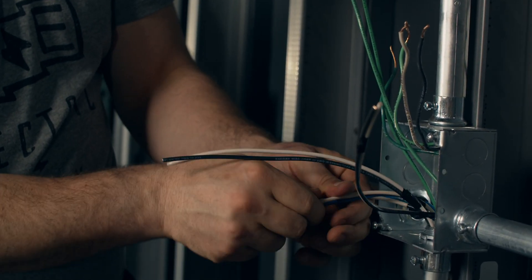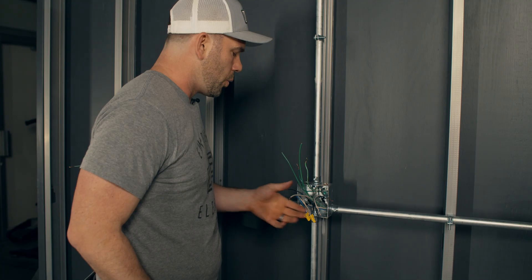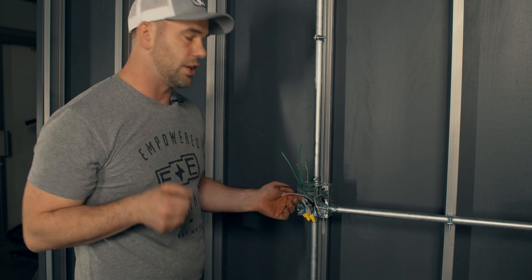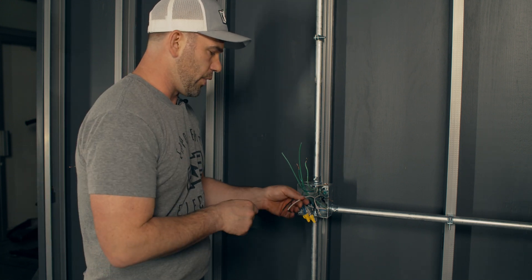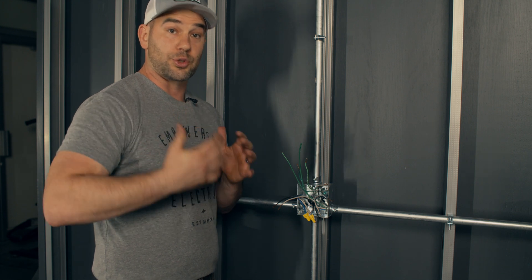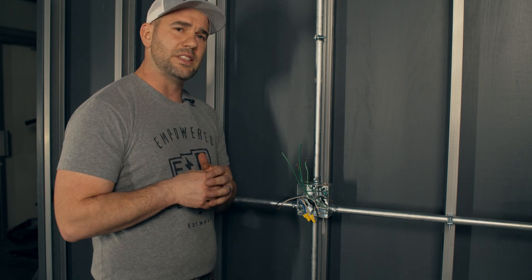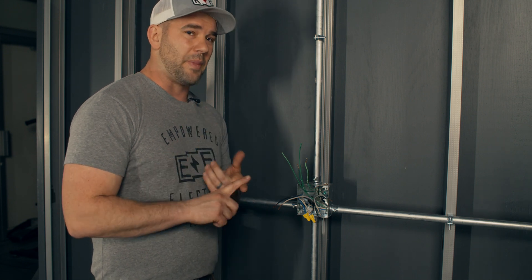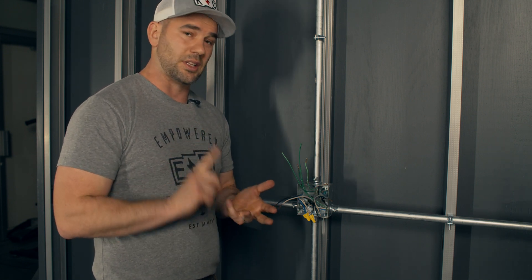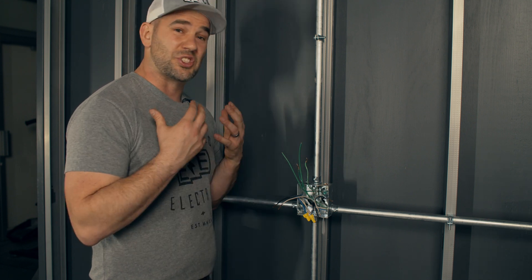Push them in the back. One of the reasons people pull stranded wire is it has a lot more flexibility, so when you're pulling it through conduit that has one, two, or three 90s in it, it's going to pull a little bit easier. But when it comes to makeup, pigtail, landing on things, and box makeup, it's just not as good. So while pulling might be easier, I don't think the overall quality is better.